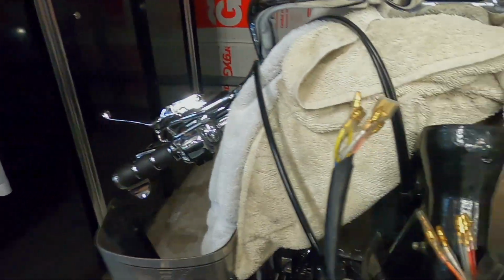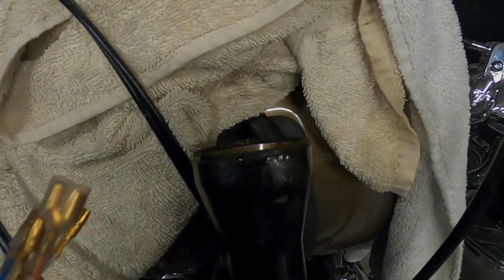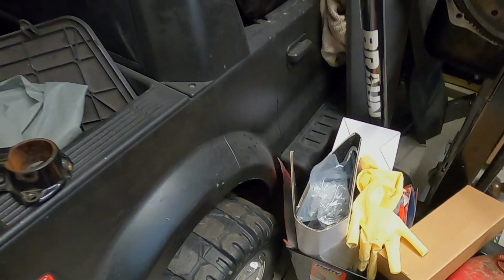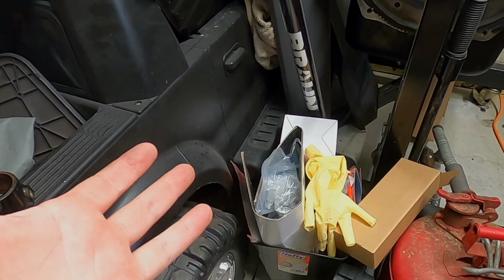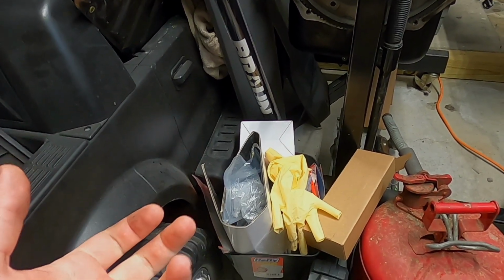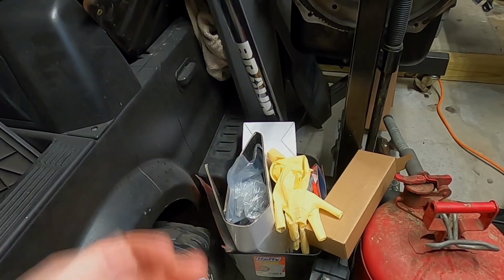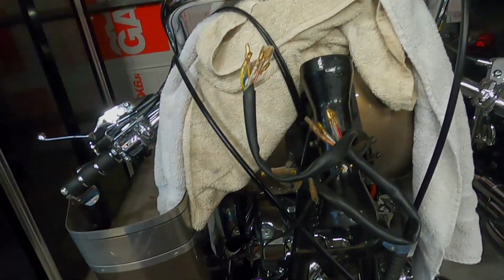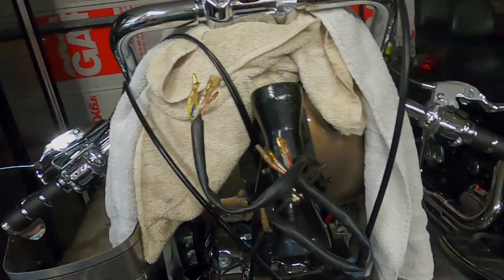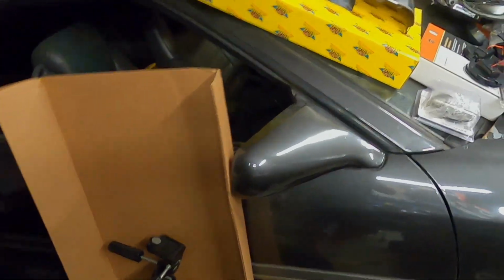And I figured while I was there, well, if I'm taking the front forks off, I may as well go ahead and replace these steering bearings. Glad I did. The other one is already in the garbage because that thing was so crunchy. I couldn't tell from the handlebars themselves, but man, when I got that bearing out and actually rotated it around, that thing was super crunchy. So we're gonna drive the races and everything out, and I've got a new one, all balls.